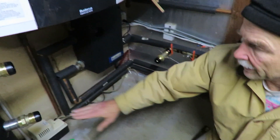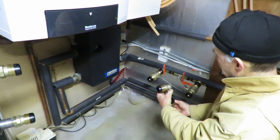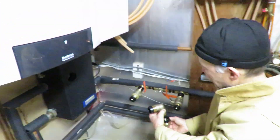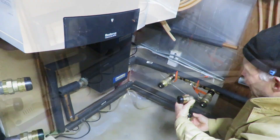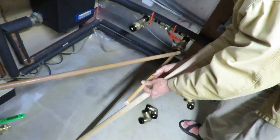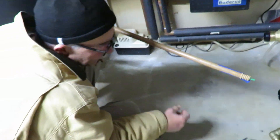This is not at the same level as this, so the way this is going to work is it's going to come out here and then go like this, so I can transition at any angle. I just have to be careful to make sure everything's in a straight line — where those two lines intersect is where these go. So right now the elbows would go right about here. We're trying to figure out how long to cut the copper pieces here so that they meet up exactly.